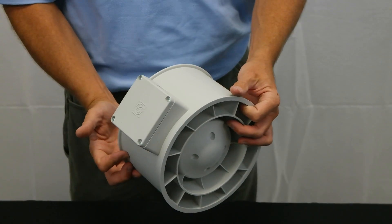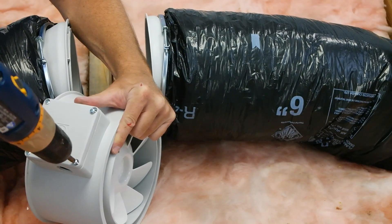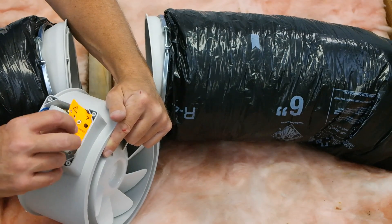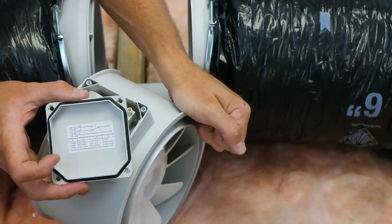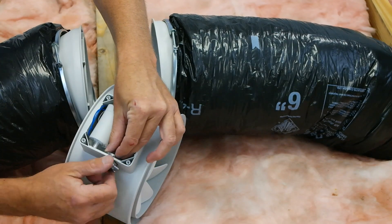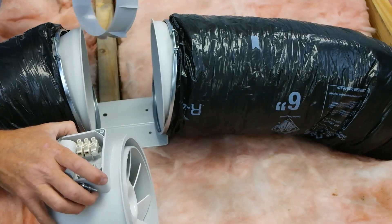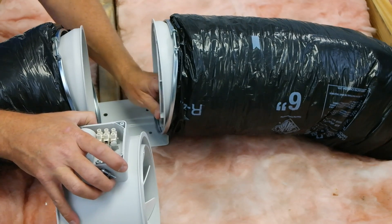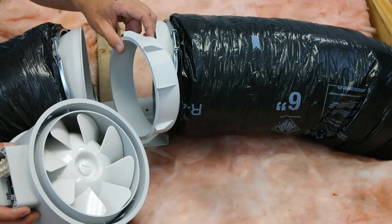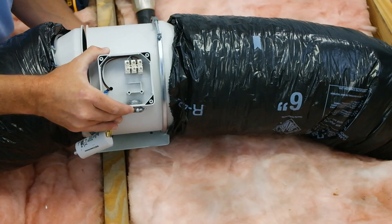At this point we will wire and install the motor. Please note it is important that you adhere to and obey all local wiring codes. Start by removing the junction box cover and remove the caution tag. Notice that this fan is double insulated and therefore does not have a ground connection. The junction box cover has a wiring diagram, so keep this within reach for reference. Now install the NM cable connector into the hole of the junction box. Before you mount the fan motor to the mounting flange, make sure the intake ring is on the intake side of the fan — this cone helps air flow smoothly to the fan blades. Slide the fan motor into the mounting flange and tighten the metal clamps to ensure a tight seal.